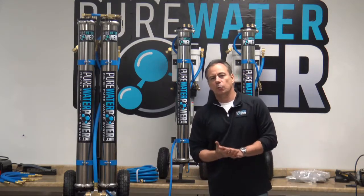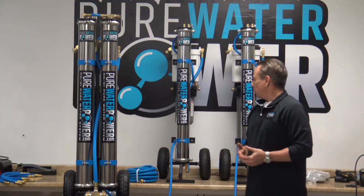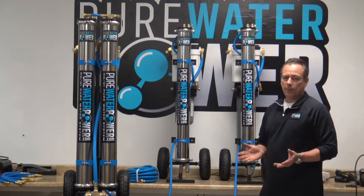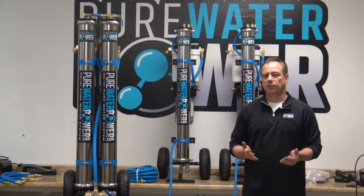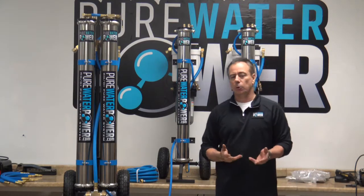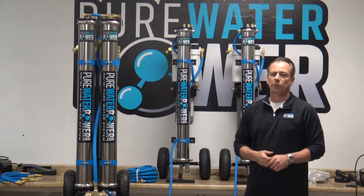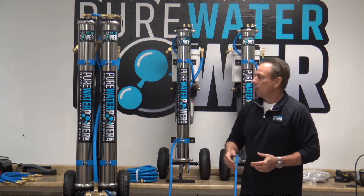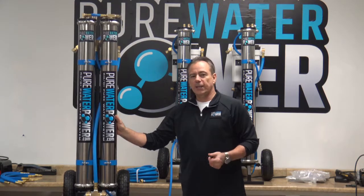To give you a little bit of education on what these systems produce and how it will affect your usage: either of the two single ROs will produce about three quarters of a gallon per minute. That means you can operate a single pole with four jetted brushes up to 50 feet.